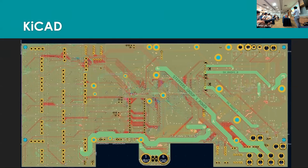Here, everywhere, we're using locking connectors to make sure that even if the robot vibrates a lot, the wires can't fall out. You can see the amount we had in version 2, it's like 3 times more wires. So it's a debugging hell, because sometimes one piece of wire can fall out and you don't know why. If you're using wires in something that's going to move a lot, I really recommend using servo wires because they generally have very thin strands of copper in them. If you use wires that have fewer thicker strands, just by moving a few times, the thicker strands can break more easily. It's really hard to debug when you have a lot of wires and you think one of them is somewhere in the middle broken and it's not visible. So we had a lot of debugging because of that.